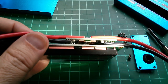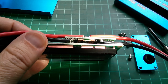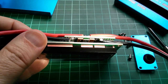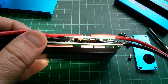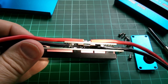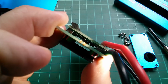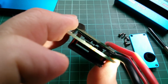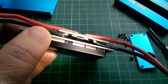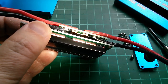So you can see there's a huge, great current measuring resistor. Oh, can we read what that says? R-O-O something. Can't quite make that out, but it's a massive resistor. It's in the negative line, so it's measuring current in that line. Also on that board, there's some sort of microcontroller. You can see there, there probably isn't a lot else. It's just measuring voltage and current and then multiplying those two together to indicate power.